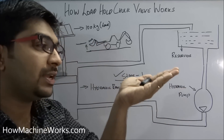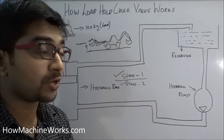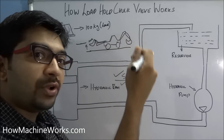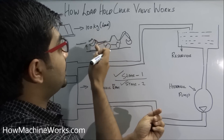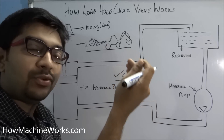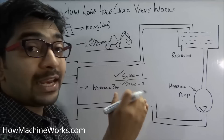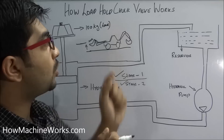At this stage, when he lifts it to this section, we close the valve lock and the load is held at this particular stage. When we want to further lift it, the hydraulic pump needs to supply flow again to the hydraulic rams to create the pressure. At that point we already have a load on the bucket, so this load will act downwards, giving a tendency for the bucket to move downwards. At the lag of 2 to 3 seconds it can move downwards — this can create accidents. So to avoid that, this bucket needs to be fixed at this particular stage until the hydraulic pump is creating enough flow to lift the load.